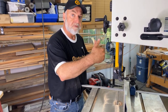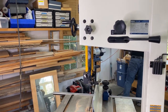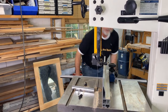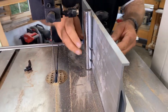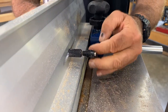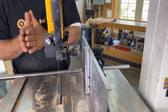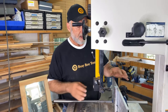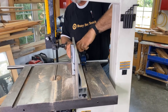I already showed you how you can adjust the fence to match the cut of the particular blade. A standard fence is designed to do two things: keep the wood a certain distance from the blade, and guide the wood in a certain direction. It's that direction aspect that can sometimes cause a problem — if the blade wants to cut one way and the fence is directing the wood slightly differently, you'll have problems. If you have a small amount of that problem, you can fix it using the method I showed you, where the actual angle of the fence can be adjusted within limits.